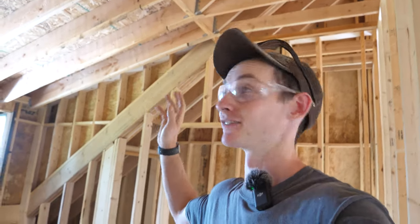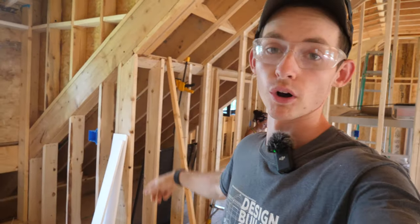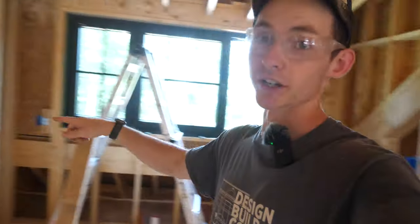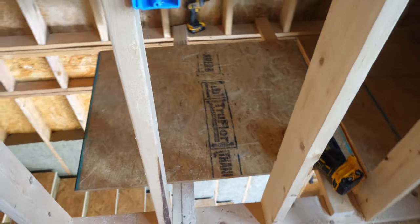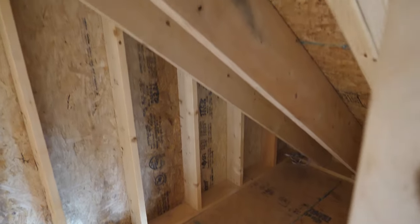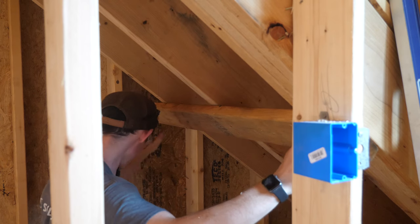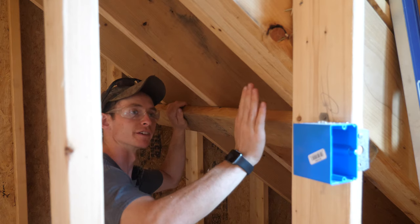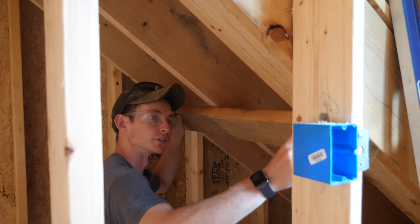Well, for the most part I have a little bit more to do above the stairwell, but before that I need to frame the little mini wall that the Amish guys conveniently forgot about. It's one of these little baby-height — about five-foot-tall — walls, similar to the pantry and the master closet, but this one goes above the stairway. So right now we just have the sloped ceiling and I've got to put up a little wall. First step was to put a little temporary platform — a couple of 2x4s and a scrap subfloor sheet — and the wall will go right at the edge of that LVL header all the way up to these rafters. I took my six-foot level straight up from the face of my LVL, put a line on my rafters, and eyeballed this until my plumb line cleared the corner of the board.